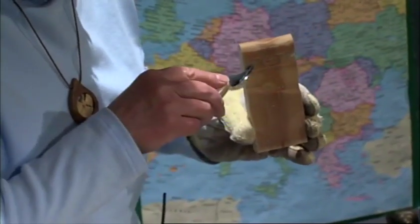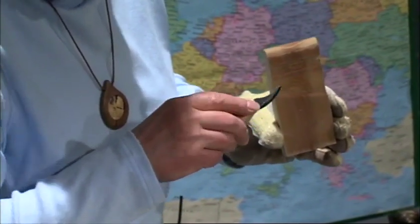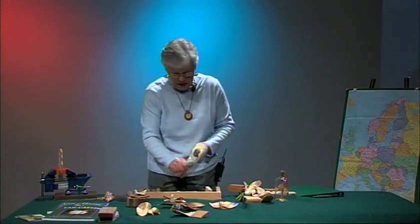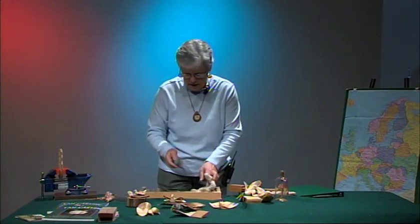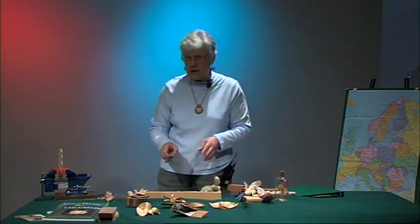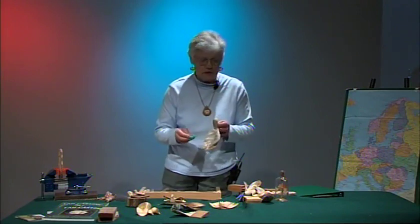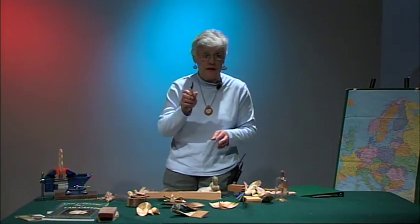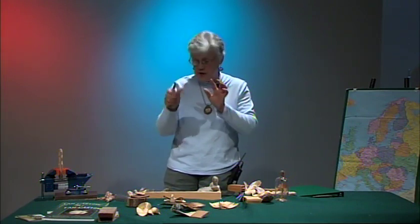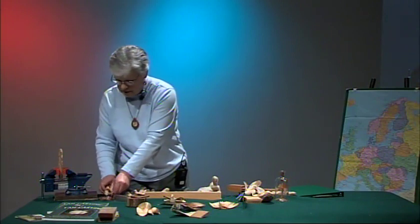Now we've got our interlock cut and our hinge cut, and now we're going to rive the wood. At that point you're going to take your thumb guard and glove off. When you're working with gouges, you don't need the thumb guard either — it's only when you're working with tools like the Pelican knife, because that sweeping curve can come back and get your thumb. So I'm going to move over to the vise.